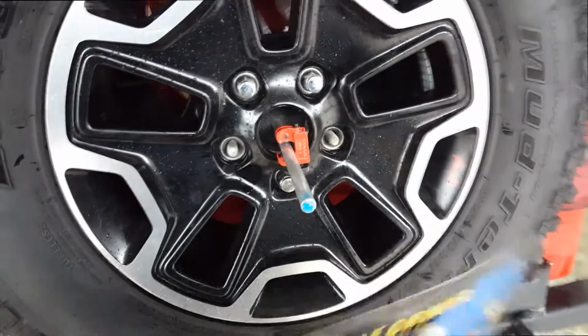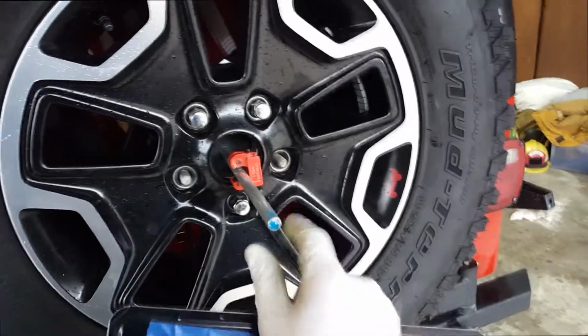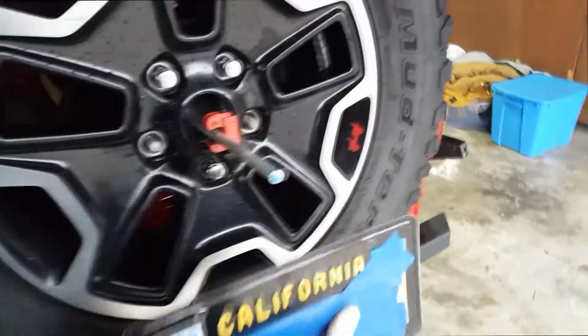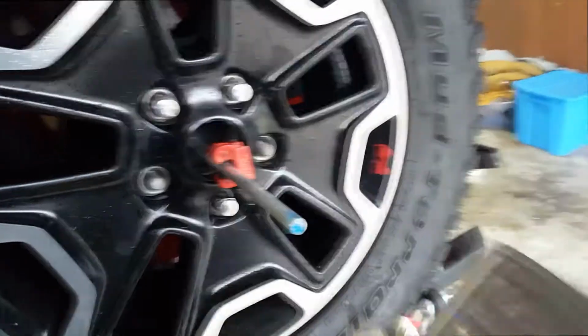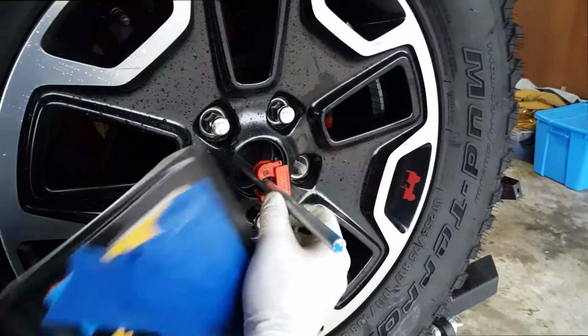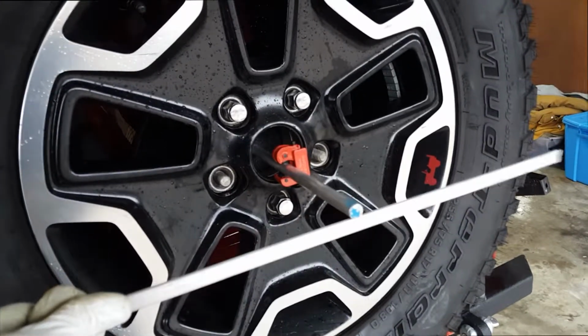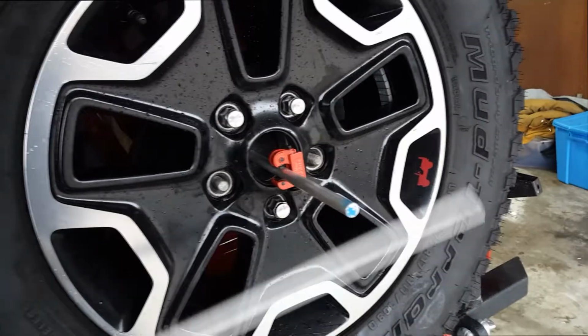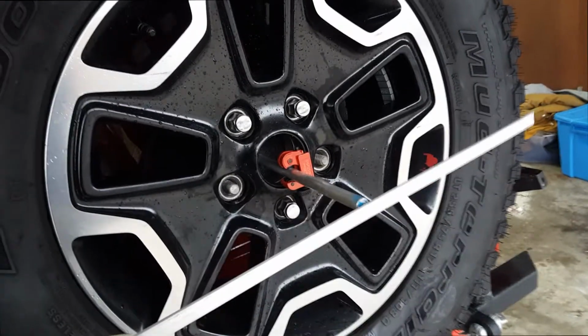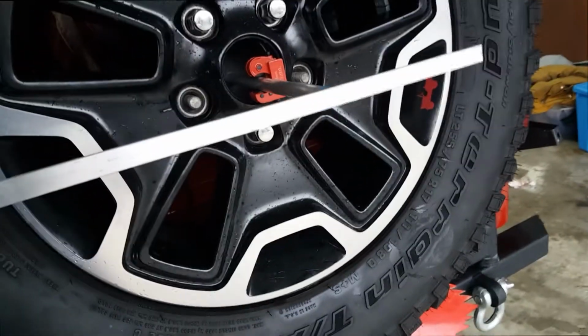Once you do that, I'm going to show you the back brace that we're going to make up here. For me, I'm going to cut this back and then use a back brace, which is just flat bar, and weld that around here. So this is going to get welded up like that, but it's going to be back here more. Then drill the holes on the ends and fit it up with the license plate.